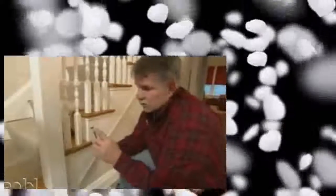All right, here's the fastener we're going to use to hold the newel post in place. It's actually used in engineered lumber all the time. It's actually got a T-head or a flat head. The shaft has no threads on it until you get to the very end. You get about 1.5 inches of threads. Now what I want to do is fasten this newel post as high up as I can. The best place is into this stair tread. Now the first thing I want to do is drill a hole just for the head so we can countersink that.